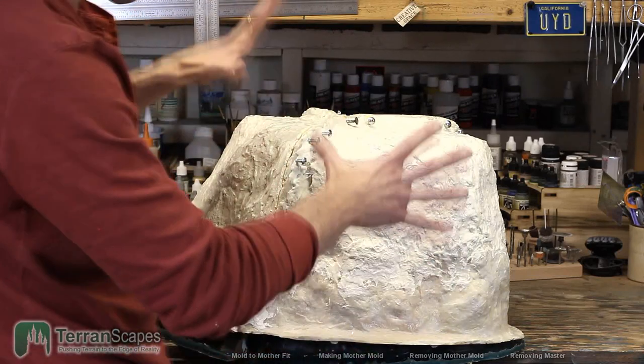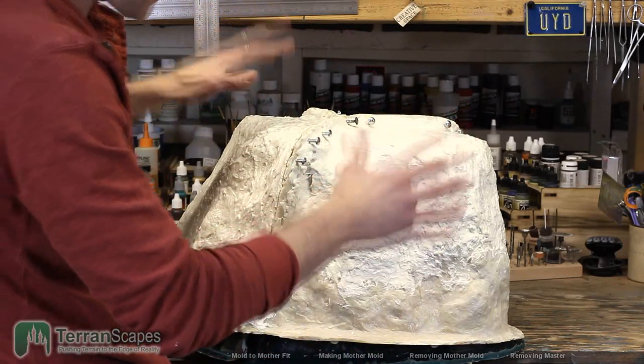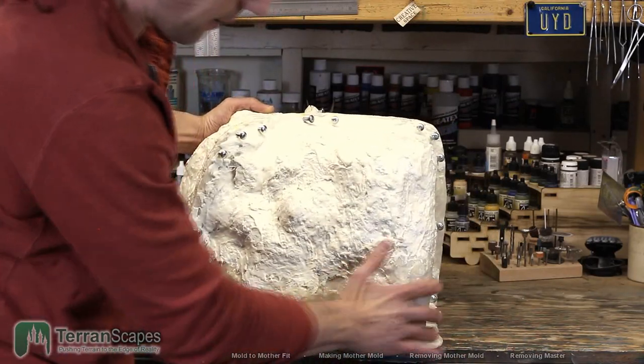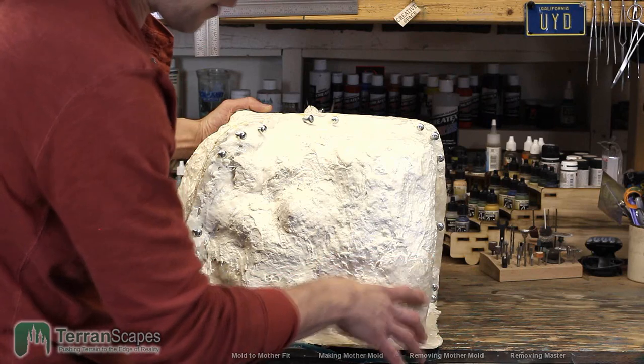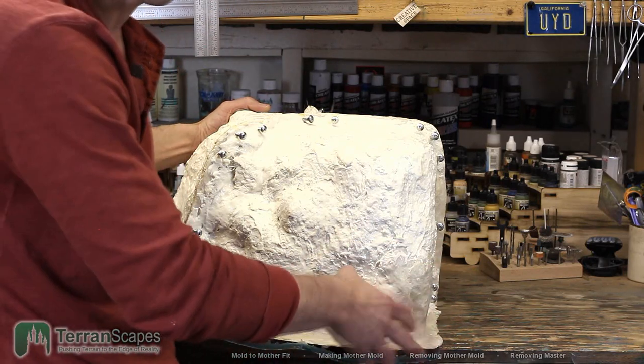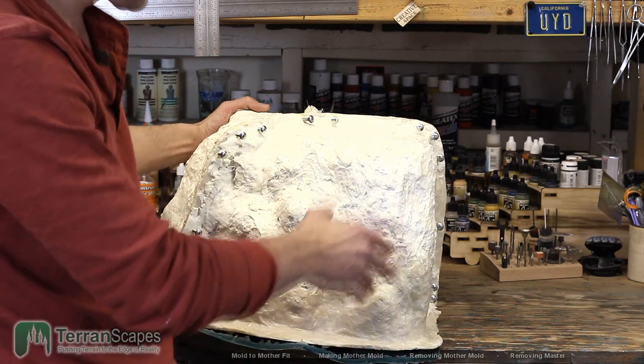I like something a little more durable. So I used Plasti-paste, and you can see the Plasti-paste exposed down here. This is basically a fiberglass compound that Smooth-On makes. It's a two-part compound, like a fiberglass epoxy. Mix it up, trowel it on.